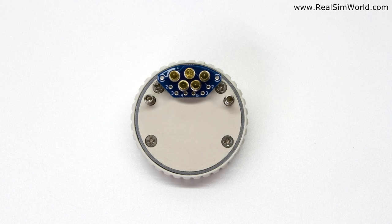There are five gold-plated pins on the thumbwheel, and each thumbwheel comes with an adapter fitted with five caps, so you don't need to spoil the shiny coating on those pins with solder. The first pin from the left is 5-volt supply, and the third pin on the right is ground. They are reverse protected, but please don't exceed 5.5 volts when using with your own electronics.